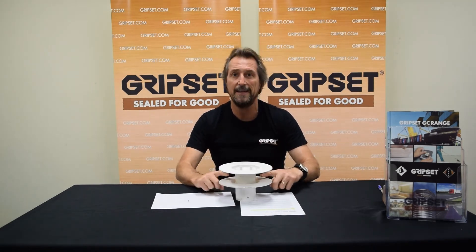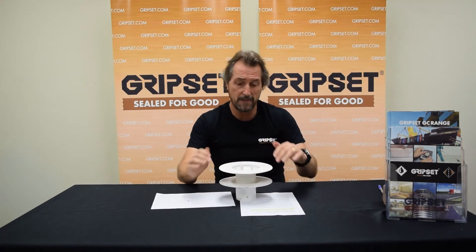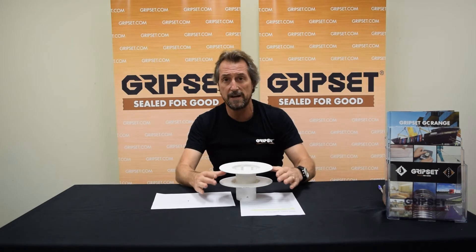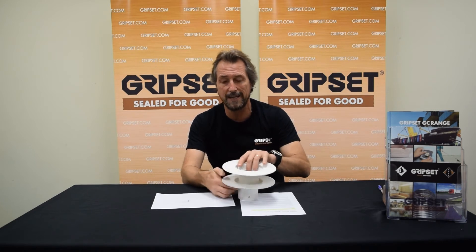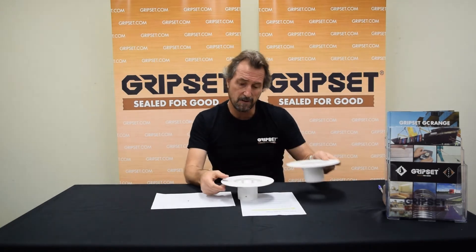As you can see, if you have the screed waterproofed around the edge, you're going to go back to what I mentioned months ago when we showed the evolution of flanges — you're just going to trap moisture around that base layer, the water can't go anywhere, and the screed is going to absorb a whole lot of water. So it is very important: if you are going with the method of over and under a screed, a puddle flange needs to be used with both systems.